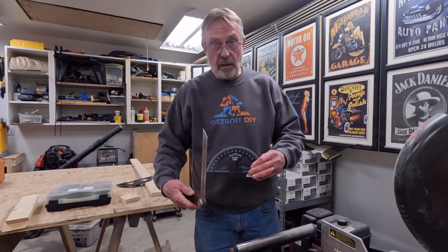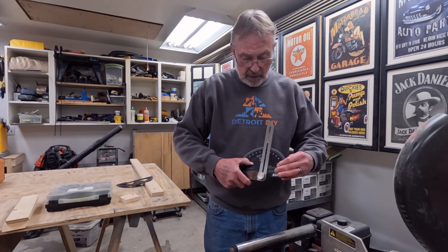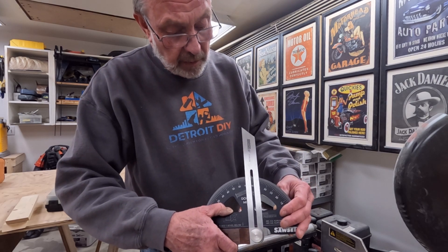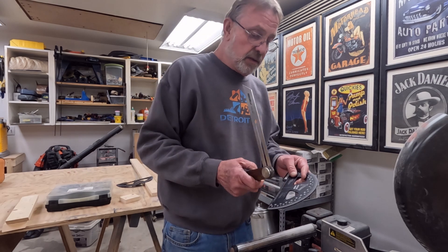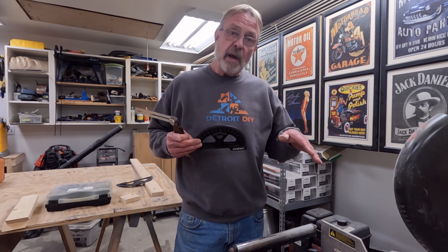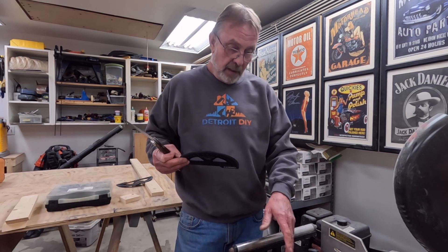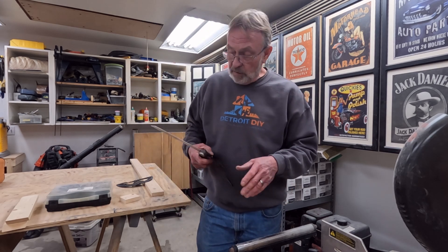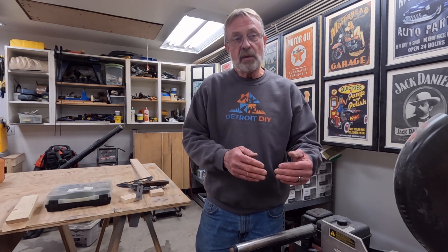On the double miter side of the Sawset, we're going to use our T-bevel just like I demonstrated earlier and get our reading — it's going to be 44 and three-quarters. So the miter saw: this is your exact miter saw setting. There is no math required, there's nothing for you to figure out other than setting your miter saw at 44 and three-quarters of a degree. My miter saw is set up for one-degree increments, so I just have to kind of guess where that three-quarters is, and that's not really hard to do. If you're just a little bit off, it's not going to matter — you're still going to get a good result.